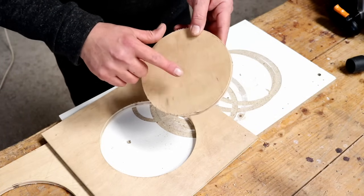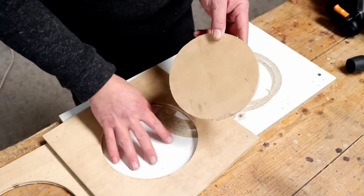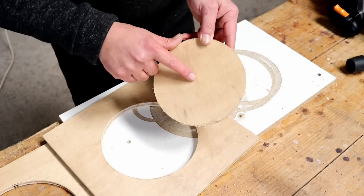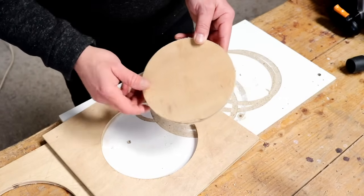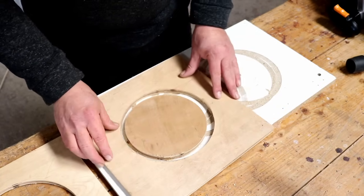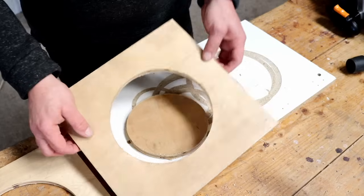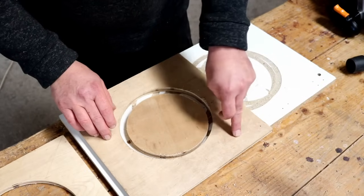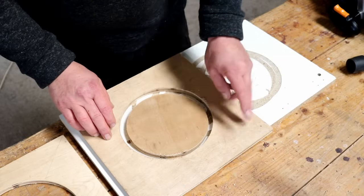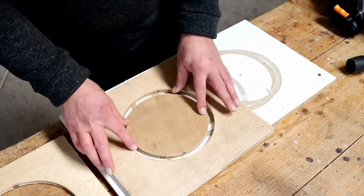So for the next project I'm doing, I needed a perfect hole, but I also needed a disc that didn't have a centre point, not to be trying to fill it. So I have what I wanted. Just wanted to give everyone an idea of how I make these jigs and templates. I'd normally write on them what size it is and what size bush I use on the router. I'd normally write it on the side and put it in the press. You mightn't need it for 6 months, but it'll be there if you want it.